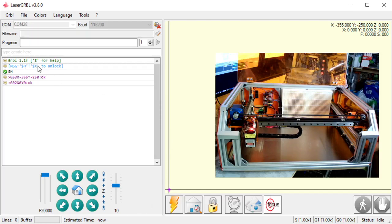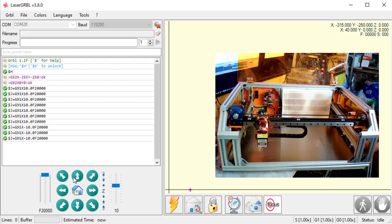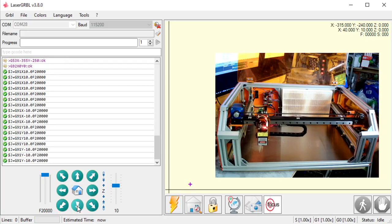So I'm connected. I selected the comm port, selected the baud rate, hit Connect, and I know it connected because of this message. I did a successful homing cycle — it's got this little green check after my dollar-sign H. Now I have these arrows down here, and I can move the head around — left, right, up, down. You'll see this little crosshair in here too. This crosshair tells you where it thinks you're at in the machine world. On the right side, this tells you how far you're moving. On the left side, this tells you how fast you're moving.